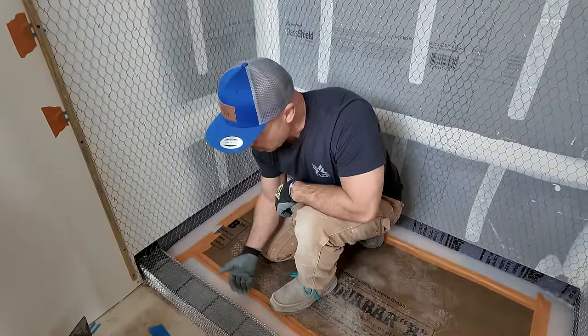Get up higher, I switch from two trowels to one trowel and a hawk. That seems to work for me. A lot of guys always work with just a hawk and one trowel. I found when you're down lower, it's more ergonomic and faster to use two trowels. But yeah, anyways, once I get up high, I like to get mud on my hawk and then work it, because it's just more distance to get up and down.